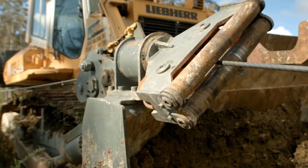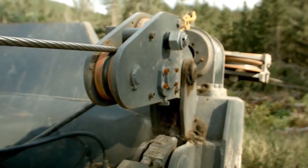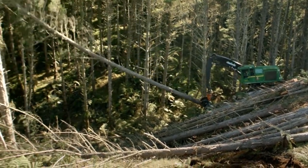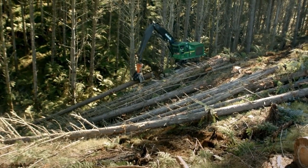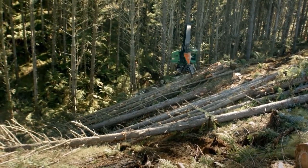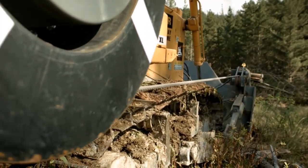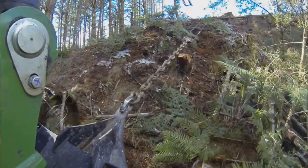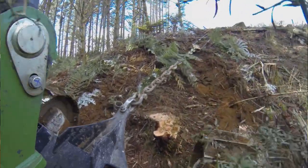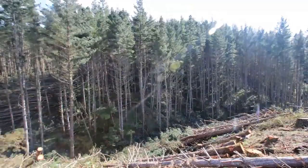There is a common misconception that steep slope machines are suspended and may fall or slide uncontrollably without the winch rope holding them in position. The winch rope is designed for traction assistance and does not hold the machine on the hillside. The winches function automatically during normal operations and are not under the control of the operator. The winches let line in or out as the operator moves the machine as they would in normal operations. Most equipment rollovers are caused by an initial loss of traction resulting in an uncontrolled gain in momentum. In SSM equipment, the wire rope assists so that the loss of traction does not occur.